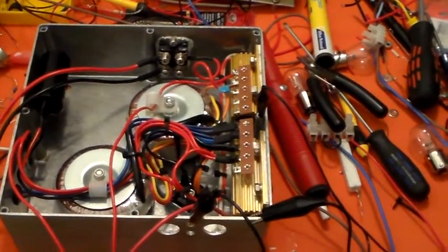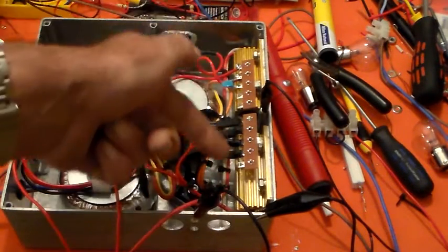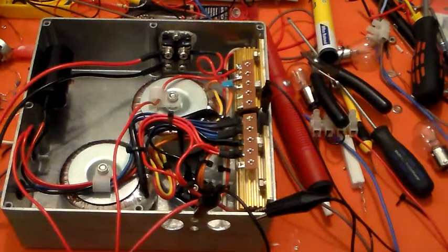There's not very much in there. There's a couple of big resistors under here — all they're doing is they're in parallel providing a 1.5 ohm resistor in series with the fan supply, just to drop the fan supply down just a tad. The only reason I used those huge resistors was that I had them. That resistor's only going to be dissipating 7 watts and they are 100 watt resistors, so there's not very much chance of those failing.